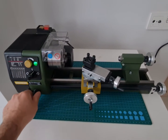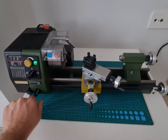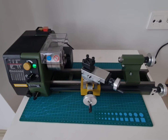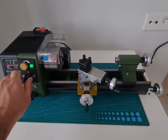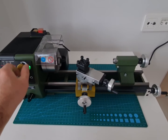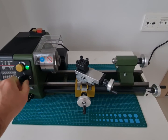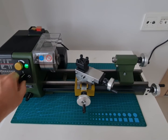There is one switch on the bottom of the panel for manual or automatic cutting. I use it for cutting screws, but with the right gear it also has an auto cutting function. I should change this switch when the lathe is stationary, but as you can see I made a mistake by changing the gear while it was running.